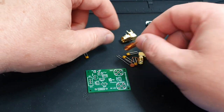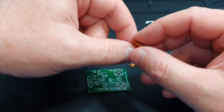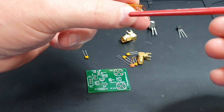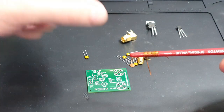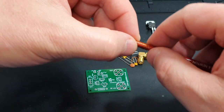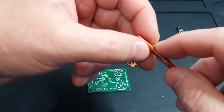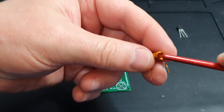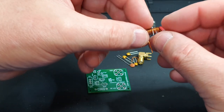You're also going to get a small coil of wire. You want to uncoil this until you've got about 12 to 14 coils and just keep it sort of straight. The way I did that was to simply put a paintbrush or a pen up the middle of it, then shape and unwind the coil to make the right sort of shape. Keep it squeezed up - you can then put some hot glue across it, and also put hot glue up the middle once you've got the rough shape, then peel the outer off to make it look nice.